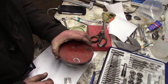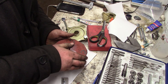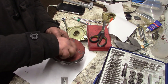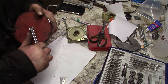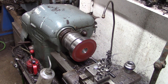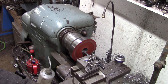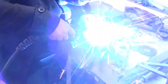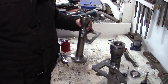That's the second half of the hub - these are the flanges that are going to hold the wheels. I'm measuring off a quad bike hub that I got - I thought I was going to use it. If you're trying to measure between threaded holes, always put two bolts in because you can measure the outside of the bolt, which makes life a lot easier, then subtract the thickness of one bolt from the whole measurement. Now I'm just putting those flanges on the hub and welding them on. I did face them off in the lathe again afterwards but I missed filming that bit.